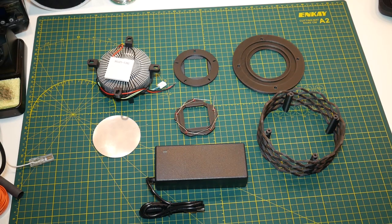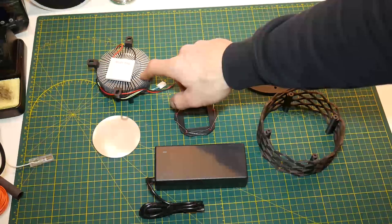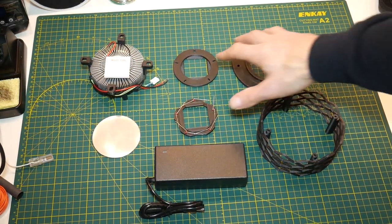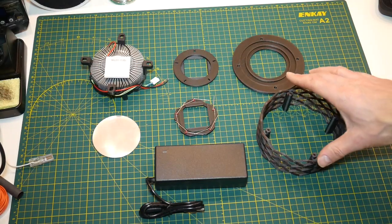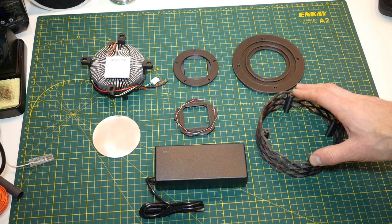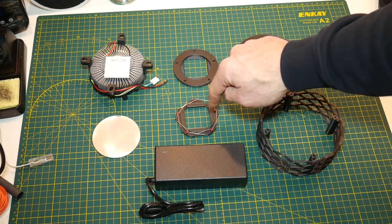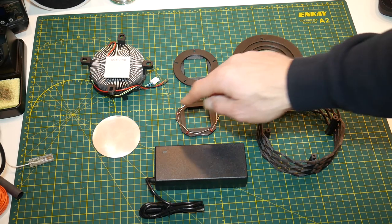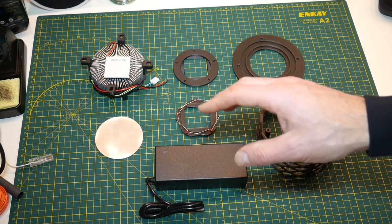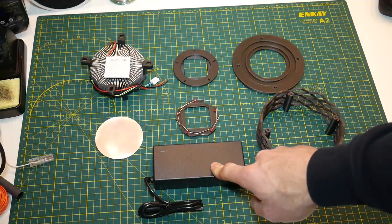Now that we have that brief explanation out of the way, let's look at the major parts for this project. In the top left you'll see the peltier plate with the CPU heatsink and fan — it comes as one unit; I found mine at my local hobby store. On the right you can see several 3D printed parts — I'll provide the files in the description linking to Thingiverse so you can download and print them yourself. One part already has small red LEDs pushed into it — I'll show how I did that in the next few steps. Here is a three-inch diameter, two-millimeter-thick aluminum plate — about 14 gauge — and at the bottom a 12V, 5A DC power supply.